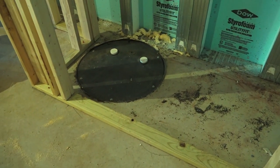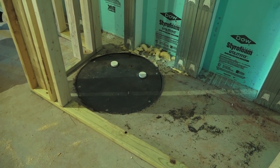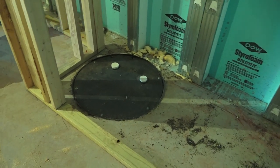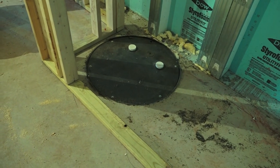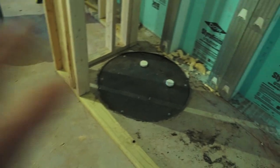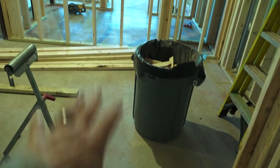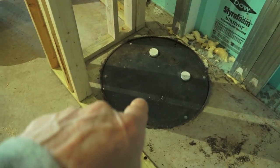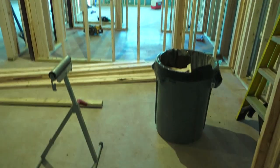We're going to utilize the location that the builder gave us, which will save us a lot of time, labor, and materials. Otherwise we would have had to put in a new sewage ejector pit. So we're saving a lot of labor there — that's the main thing because these are very labor intensive. It's a lot easier to just jack four inches of concrete and dig a ditch down about 16 inches than it is to dig one of these babies down into the floor three feet deep. Much, much less labor involved there.